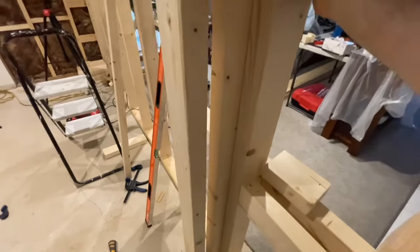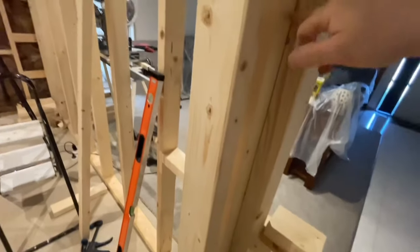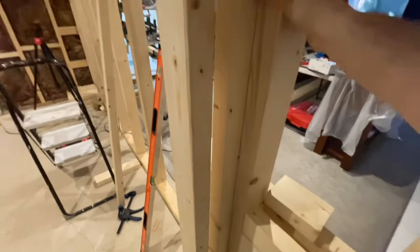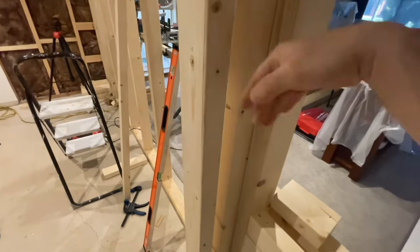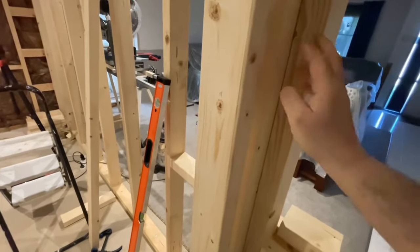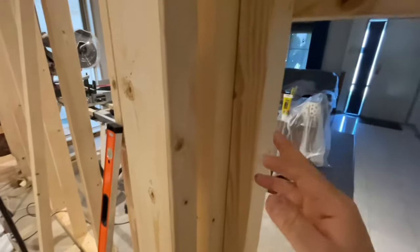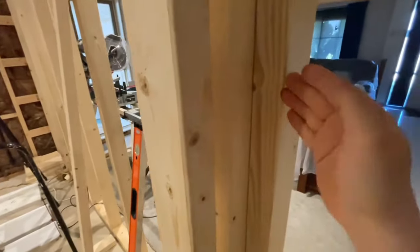And as I've found out, even on external walls, you create a cavity in there that you can't put insulation in afterwards. And yeah, it becomes a cold zone where heat can escape. So this is a better way, because there is no cavity in between all these studs, because you've got one this way. This one overlaps half of that one on this side, and then you have another one which is level with the other half of this stud coming out this side.